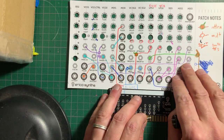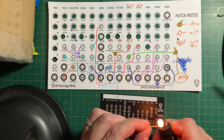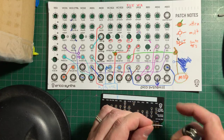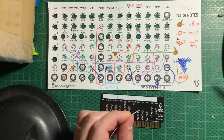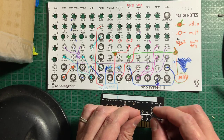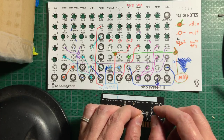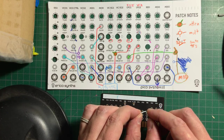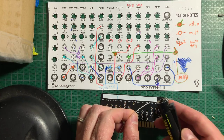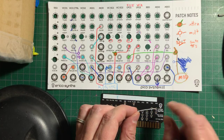So you're gonna be doing a lot of wire stripping, and that can be tedious. If you use a lighter and just heat it up and pull with your fingernails like that, you expose the wire enough without having to use pliers. Pliers are actually risky because you can cut a few of the strands in there and end up having a weaker connection. So this is actually even better using the lighter. Okay, just be careful you don't burn your finger. Wait a minute after you've burnt it before you pull out the plastic on this, right?